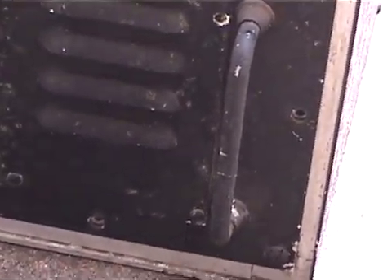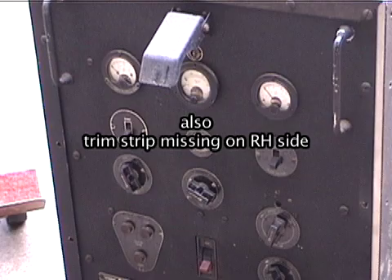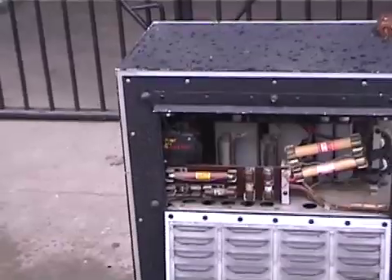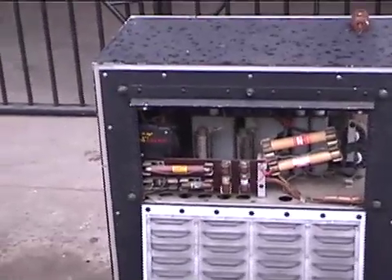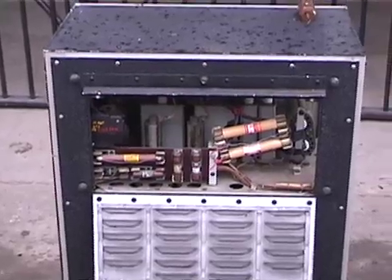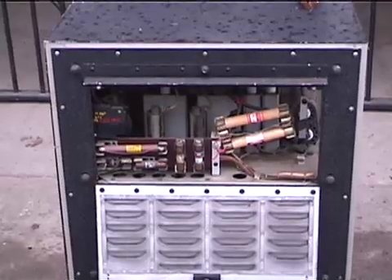One of the handles on the bottom is bent. Numerous screws are missing from the front panel. The side appears definitely intact but is dirty with scratches and chips. In the tube compartment, there are two 836s probably for low voltage and a pair of 866 solid-state replacements in place. All major components appear to be present, but there are a fair amount of previous-owner modifications and additions to the fusing circuits.